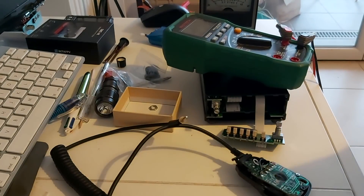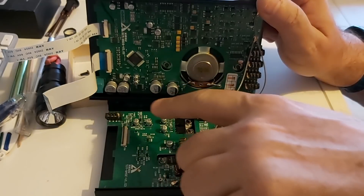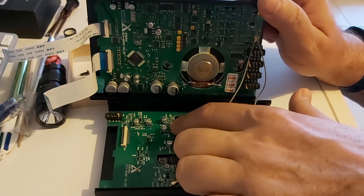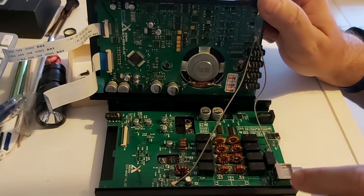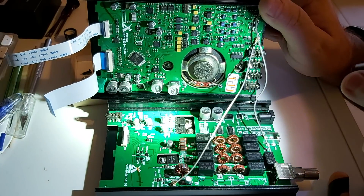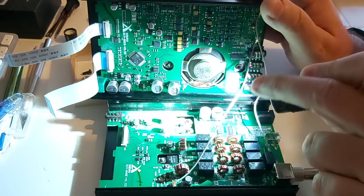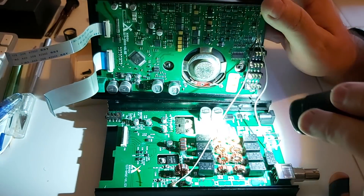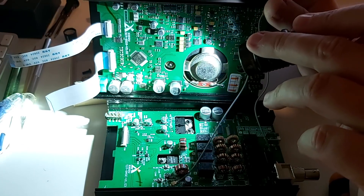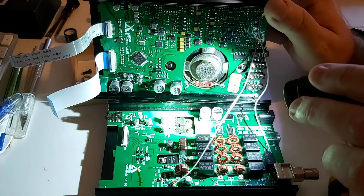Here's an interesting look inside — we have two boards basically. There's a logic board here with a processor, the speaker, the filter board down below, and the power amplifiers. That goes out to the antenna connector. The problem is that to change the jack I would have to take the board out of the case and unscrew those transistors. I think there's enough space to solder in place. Those transistors have been soldered by hand, not by machine, and there's a little bit of oxidation.